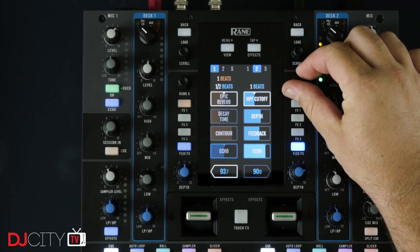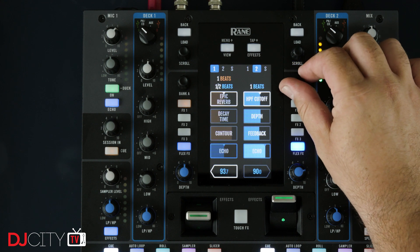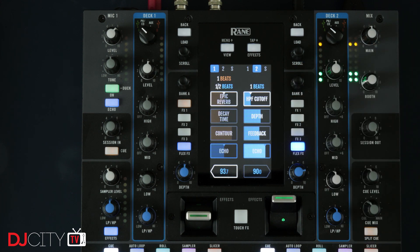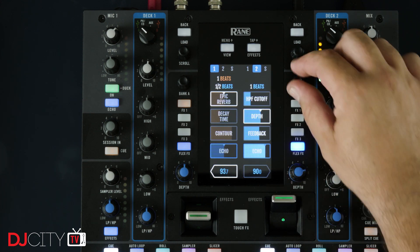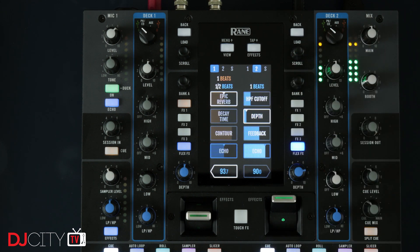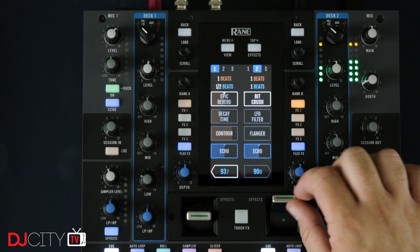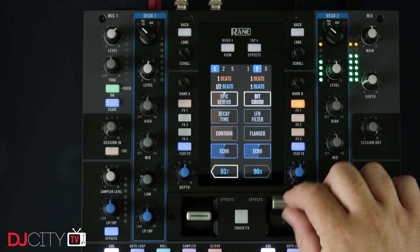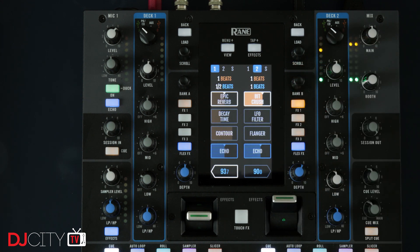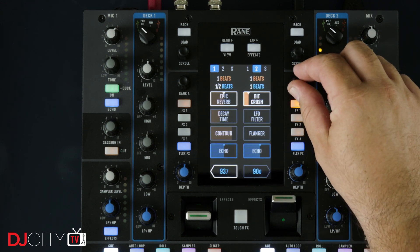The third main display page on the 72 is devoted to effects, and there is a lot to talk about. Firstly, you have the hardware flex effects with things like echo hold, echo reverb, and flanger — these are post-fader and sound great. It can be a little bit fiddly to dial in the perfect setting to your taste with some of them; it's certainly not as instant gratification as what you find on the DJM-S9, but there is a ton of power there if you take time to work with the options. Then there is also access to the effects in Serato DJ Pro, and not only can you stack those on each other, you can stack them with the hardware effects too — absolutely crazy.